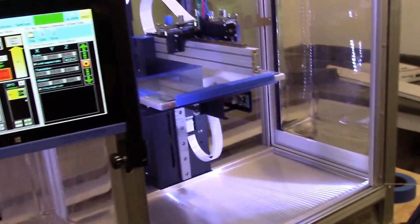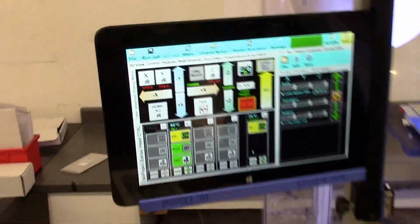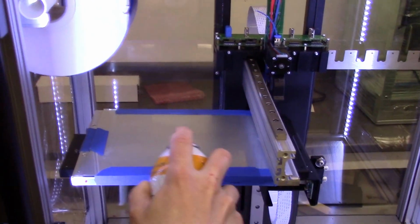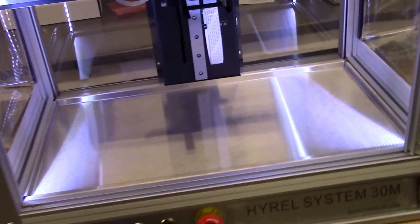If you're going to print with ABS, we recommend that you have some sort of an extra hold hairspray. We don't get any endorsement, but we do encourage people to use Aquanet or something similar with the extra hold. This is from Joe's personal stash. We didn't set up the level. Just make sure you don't get any up near the moving parts or the linear bearings. All right. When the bed's warm, that'll dry in just a few seconds.